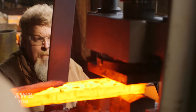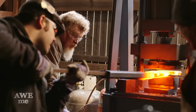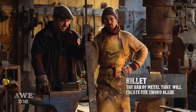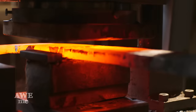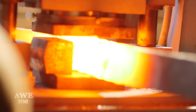You'll see that we change dies on the press. This is done so that we can break down the bar faster by having a smaller area that we're pressing on. Then we'll go back to a larger, flatter area that will allow us to smooth the entire piece, making the bar easier for when we begin the blade work. With Kerry and Ilya's help, we've roughly drawn out the billet to its rough dimension. Now we're going to do the final sizing using a specialty die under the press that has two half-inch stop locks, because I want the finished thickness to be half an inch before grinding in the distal taper. The half-inch allows us to size the entire thickness of the billet to an even half-inch over its entire length, and then we'll go back and take the width using the side of one of our other dies to keep everything even and smooth.